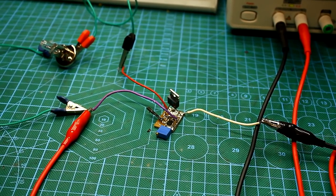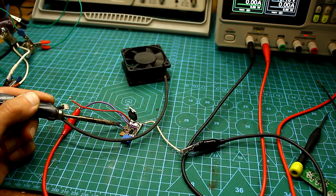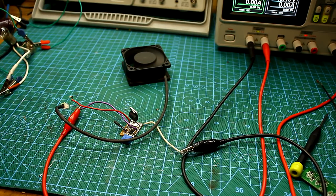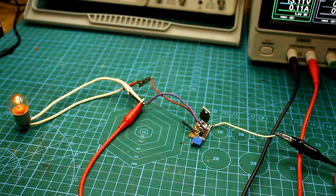And finally, the third design is a device that will automatically turn on, for example, a cooling system if the temperature on the monitored surface is higher than a specified limit. In other words, it is an automatic thermal switch or thermal solid state relay. When overheating, such a device will allow start, for example, the fan in your computer, power supply, and so on.